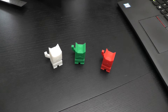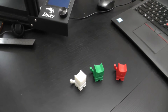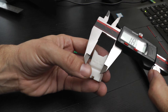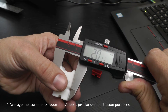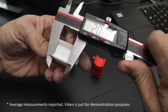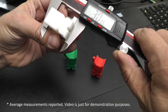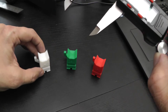Next, I printed a model specifically designed to look at printer dimensional accuracy. The CaliCat is my go-to model for calibrating my 3D printer — not only does it have specific dimensions listed with the model, it's also a great little gift for children of all ages. Right out of the box, the dimensional accuracy of the printer is very good. On the X-axis I measured 20.10mm and on the Y-axis 20.05mm, against a target of 20mm. On the Z-axis, measuring from the bottom to the top of the cat's head, I measured 30.02mm against a target of 30mm. These settings can be dialed in even closer by changing your steps per mm in the built-in menus.